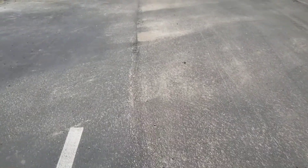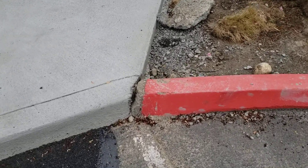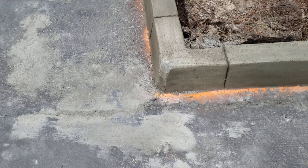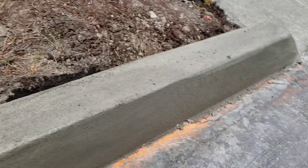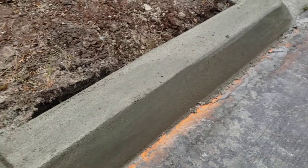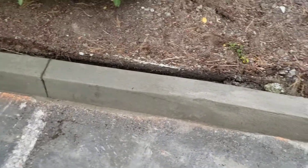When we do that — Chad — let's get a little bit of connection in here where we did our sidewalk going back to curb. The corner looks nice but it hasn't been how we've been doing our other corners that I've seen here so far. And looks like we missed a little bit of bottom — usually we cut that with the trowel and pull it off. I know we were hitting some of our better numbers, but we don't want to sacrifice our quality.